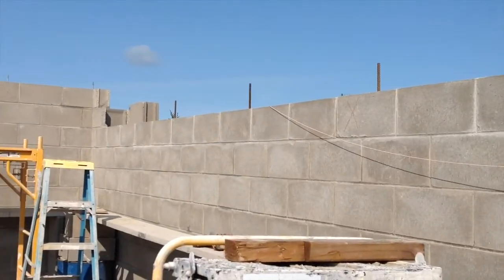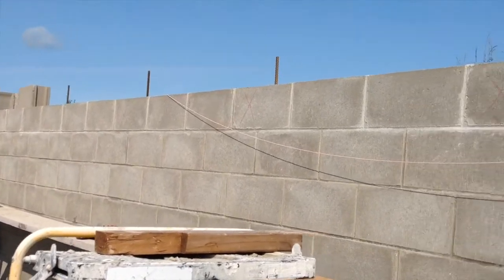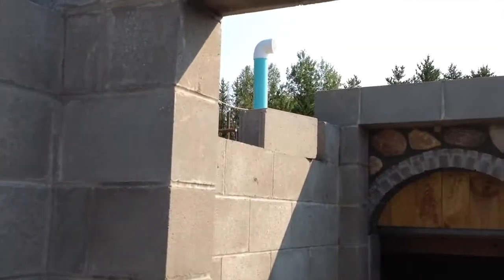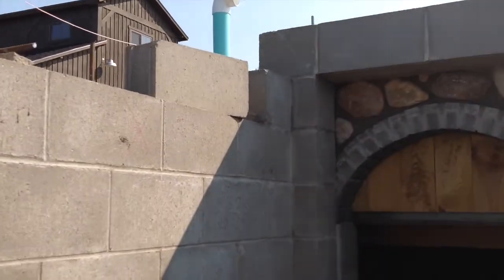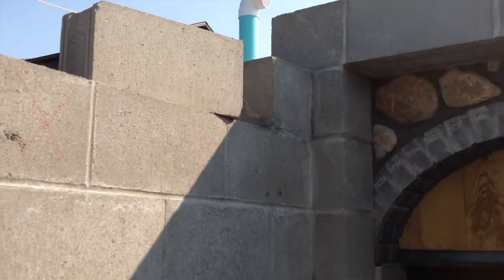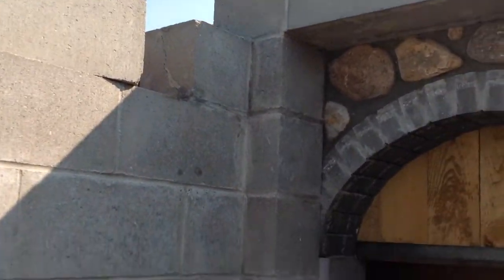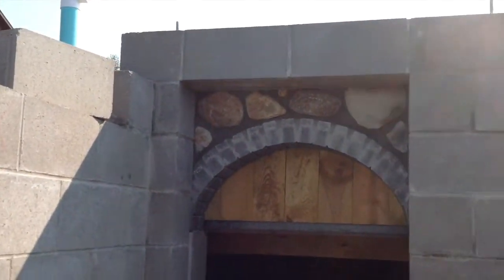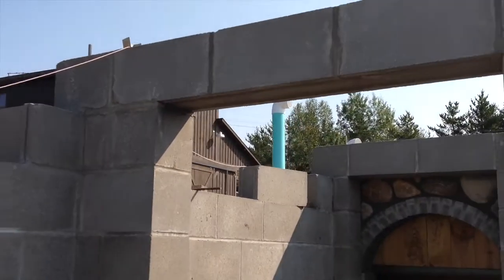I've got to do a row of 12-inch block and then a row of 6-inch block. I wanted to be able to do those other lintels, so what I ended up doing is I found a couple of the broken ones that I thought I could patch together — I glued them together and filled them up with concrete — and I was able to do the lintels over the root cellar and over the doorway into the greenhouse.